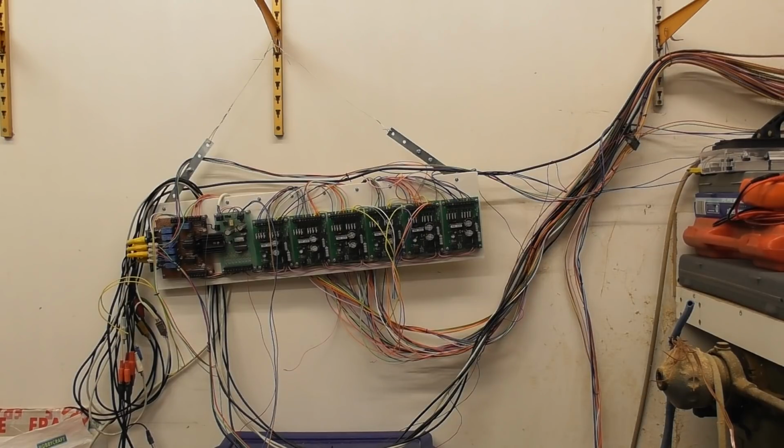And I've mentioned this before, but what that board contains is, on the extreme left, where the yellow connectors and the blue blocks are on that brown coloured board, that actually provides the switching for the 6 cameras, which are in the fiddle yard. It also provides the switching for the centre section of the fiddle yard, which I'll go into a little bit later. That switches the rail polarity, and it also provides voltage for the 3 powered tension lock uncouplers that I've got in the garage.